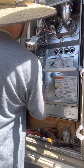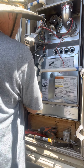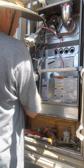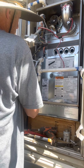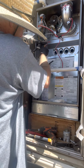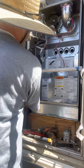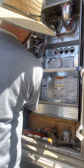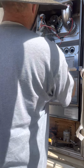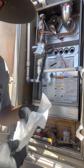And so after these orifices, I'm going to drill those holes in the burner. Come on, socket, what's going on here? Now it's set. Give it an extra little twist. Get this guy going. So after I get everything hooked up, there is a manometer that I need to get set in place. Once the power's on, I can go ahead and test this. So all the new orifices are in, old ones are out. Gives you a few extras in the kit.